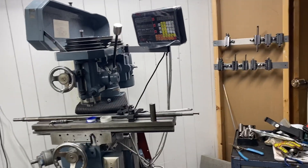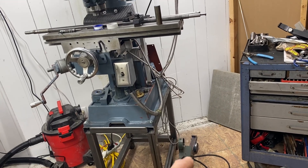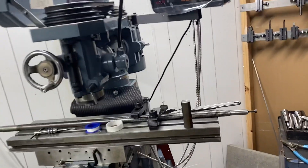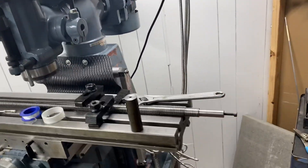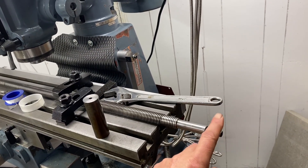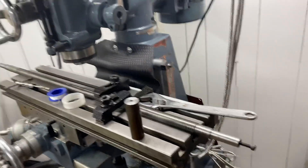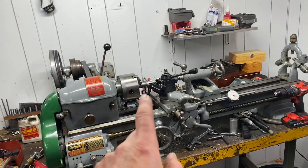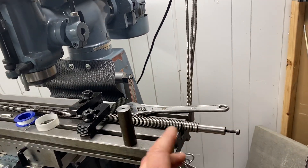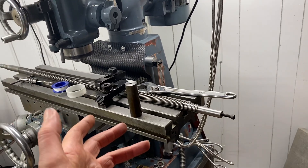The project for this morning is that I'm still working on putting the power feed onto the Enco. Part of that job is going to require that the lead screw be extended by about one inch. Actually probably one and a quarter inches because I'm just getting started on making the part to extend it. One inch three hundred is going to be a little long.